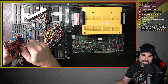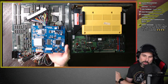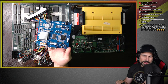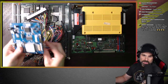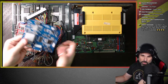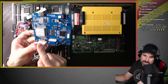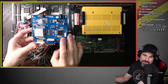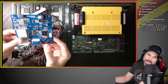This is an example of a board going from CGA to VGA. I call them the red, the green, and the blue board — you'll find a green and red version that both do CGA to VGA. This other one actually goes from CGA to HDMI, and it's a relatively newer board. The same thing connects the same way so you can go from your arcade board to actual HDMI out. Keep in mind it's not going to be super straightforward — to move the image up, down, left, right you'll use the on-display menu.